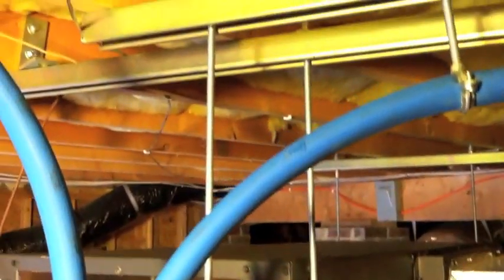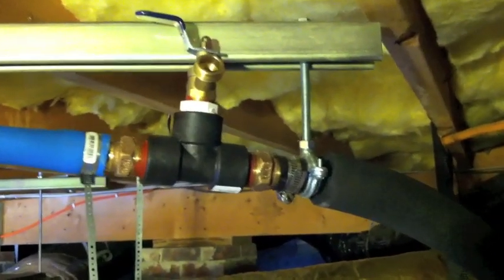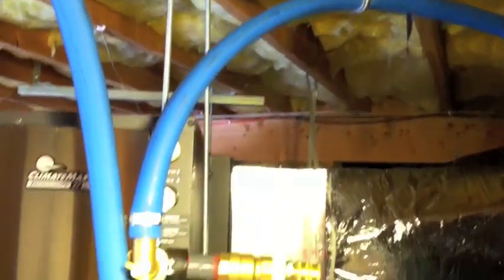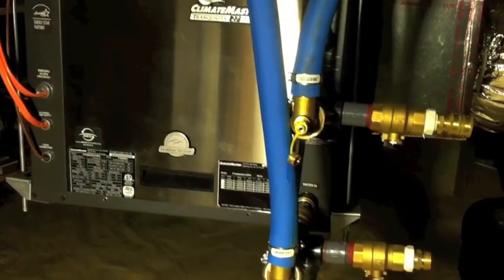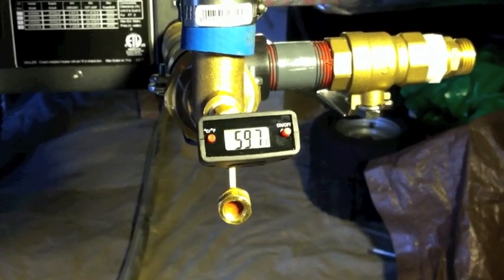The pump is a constant velocity pump that keeps water circulating through the system when it's on. The piping goes over to the heat pump. Here's the water connect kit that has pressure and temperature ports for checking the temperature going in and out. The water loop goes back out with a valve to bleed off air on that side. Since it's a non-pressurized system, you don't need a flush cart or any special equipment to start the unit up. I also mounted the plumbing to threaded rod and super strut for support.